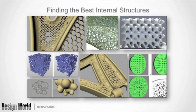We now can grow it as needed. Instead of creating a part where we say, oh, we need it to be structurally sound, so we should make it thicker and thicker and thicker, or wider, as a traditional manufacturing job shop would request you to, we now just grow that in areas. We can eliminate material and increase strength or maintain the same strength. So once we picked our structure, we picked the areas that we wanted to continue.